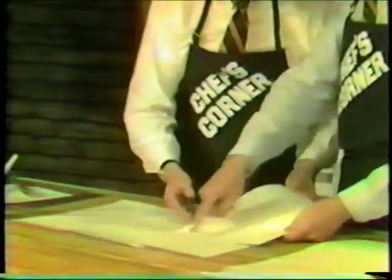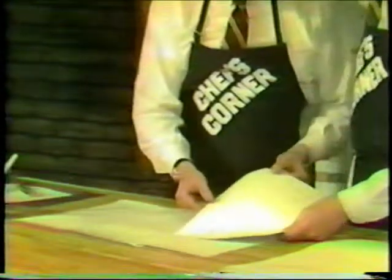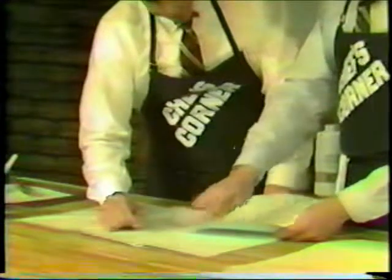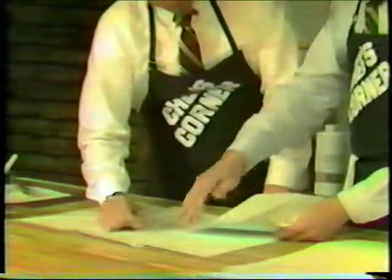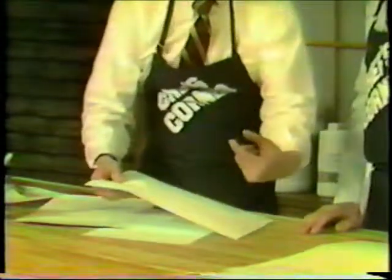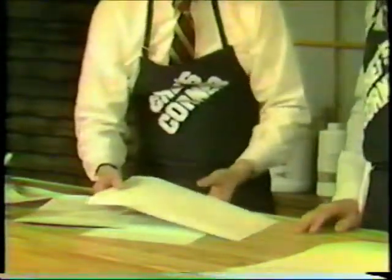They come in the straight edge. Here, you notice the straight edge for the straight edge clamp on the cylinder. Which would be the kind of a cylinder that is a dual type of clamp, straight edge and pin bar. Okay, now maybe we better talk about that before we talk about length of run. What you're saying to me here that we can see on the table is that one comes without any holes in it at all, and that would be then the way you would insert it into a duplicator with the type of clamp that just comes up out of the cylinder. Opens up like a hinge, like jaws, so to speak.